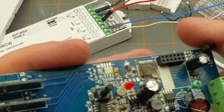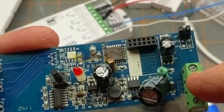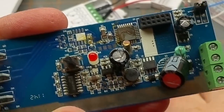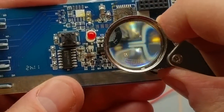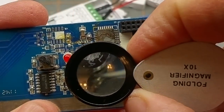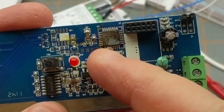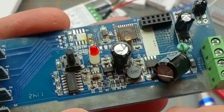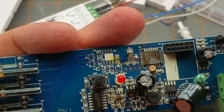And that looks an awful lot like what they've done here, if you would focus. Thank you. Got a big capacitor on the input side and some small capacitors. Yeah, I can't get in there. Where's my less zoomy magnifying glass? There we go. It's got some smaller capacitors down there beside it, and then a larger one on the output, and some smaller ones down beside him somewhere in there. Okay, so that's pretty much textbook for that. So that's creating one of the power supply voltages inside.